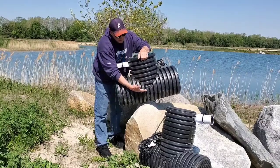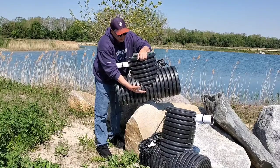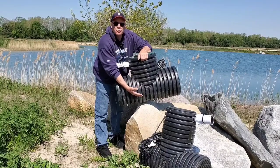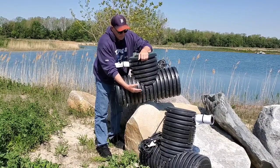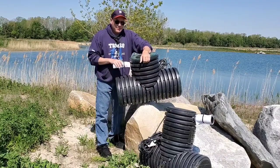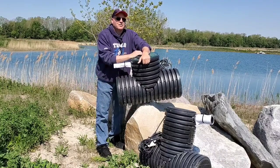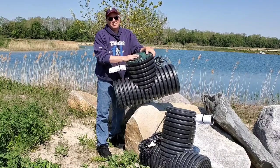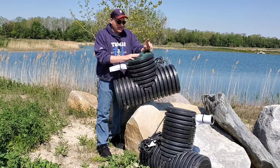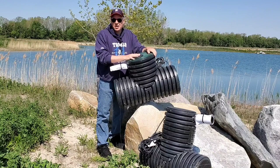So the sump pump sits in the bottom of this bad seed. This is called our bad seed sump pump system. As the water level goes up, so does the float on the pump. It's triggered, it goes off, and then it discharges. The extended chamber does two things. One, it makes your sump pump last 10 times longer, but here's another thing. It makes it possible to build your system without a check valve.